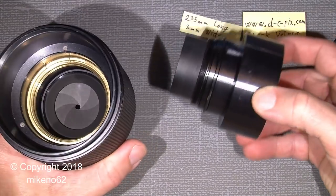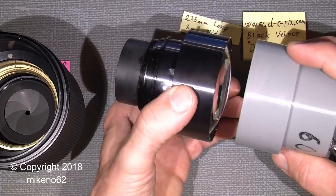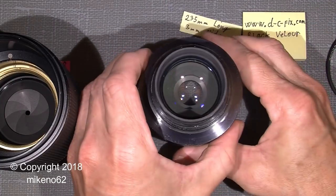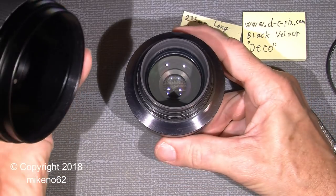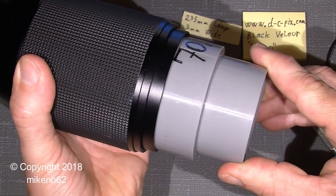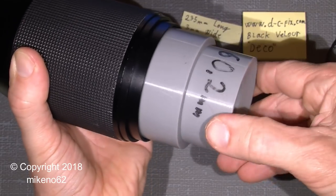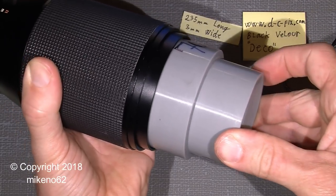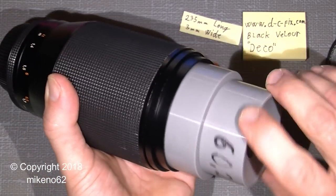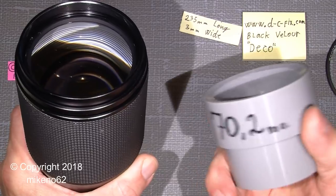So now it's time to put in the lens group, the front lens group, which is a bit dusty inside. And again, I will just use my rubber tool and just put it so, and then put the lens over and gently put it in, and going backwards, unscrew until it says click. So there, then I catch my thread, and then it's just to screw the lens group into the lens body and just tighten it. It will be tight enough when using the lens tool.